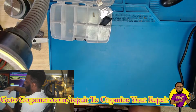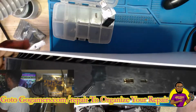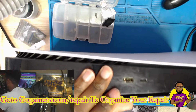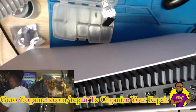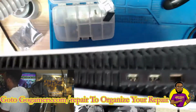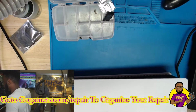All right, so as you can see, we have a PS5, and this is the disk drive only version. Now, we don't need to even go under the microscope to see what's going on with this one. Front USB completely broken out. Now let's look at the two back USBs. Both of the back USBs are broken out. So obviously this is going to require 3 new USB ports.